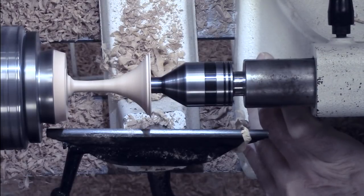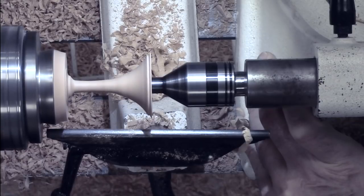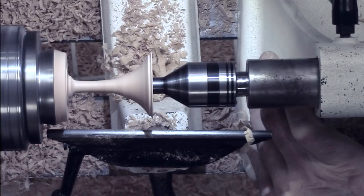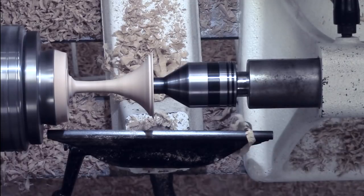I always like to make the handle, the knob, I never lock this down. If you notice a while ago it was over on this side and was vibrating, it wants to loosen itself up, but if you always put the handle over there on that side, then if it tries to fall down, it's going to tighten it more.